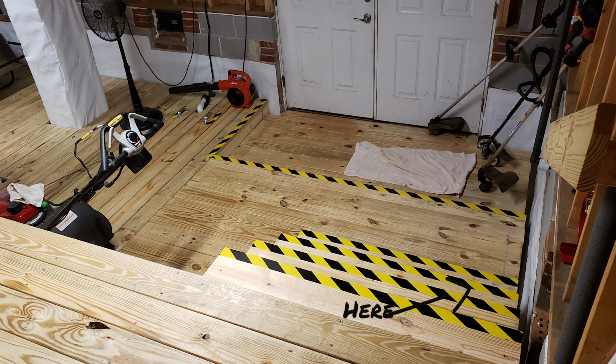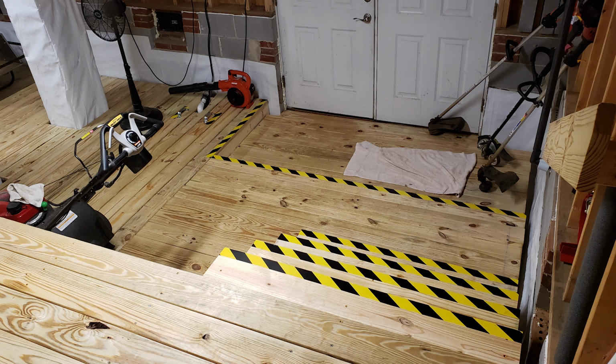It's just amazing, and it looks like you used 1x6s? Yeah, the decking is 1x6. The framing is any combination of boards, 2x4s, 4x8s. There was all kind of stuff involved there. But the decking was 1x6, and that was adequate, plenty of support. There's joists, I think they were on 4 foot centers. Anyway, it's very sturdy, very strong. It's permanent. That's not something that's going to be coming out of there.